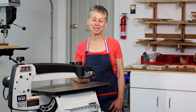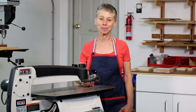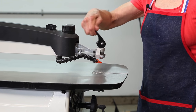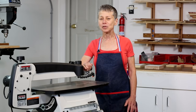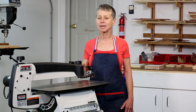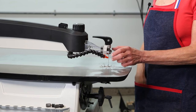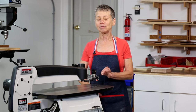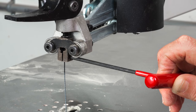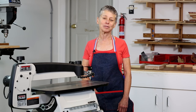While the system works seamlessly most of the time, there are occasions when you may need to tweak it a little bit. You can add additional tension through the cam lever by giving it a one-turn rotation, or if you need further tweaking, you can use the knob in the rear — but since that may throw off some other adjustments, that's seldom used unless you really have to. And if the clamp is not holding sufficiently, you can adjust the set screws on either side using a three millimeter hex key. So although you'll seldom need these, it's nice to know that they're there.